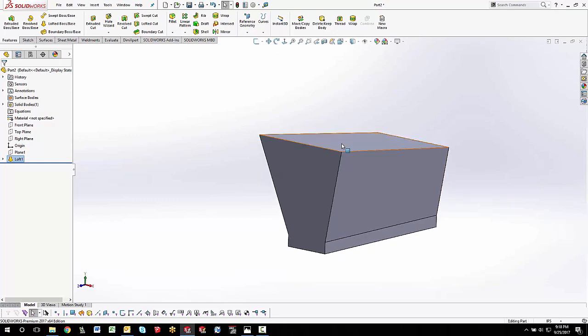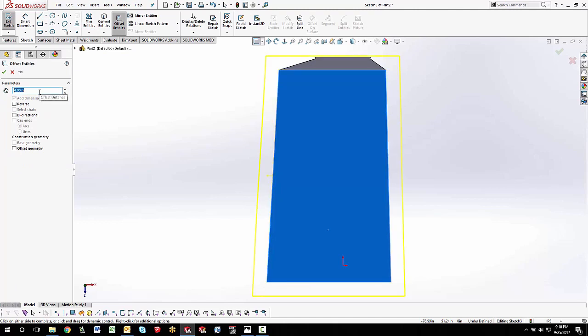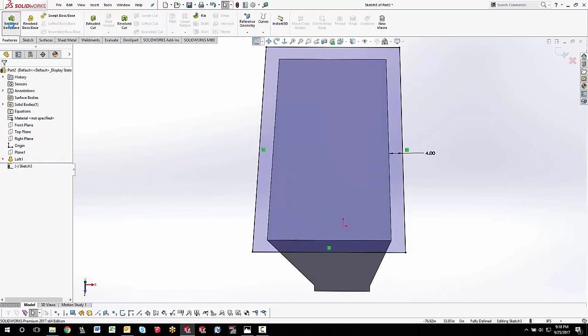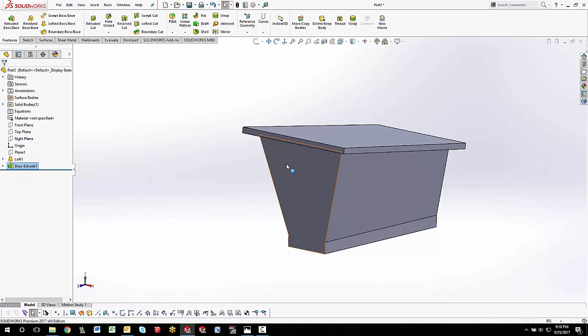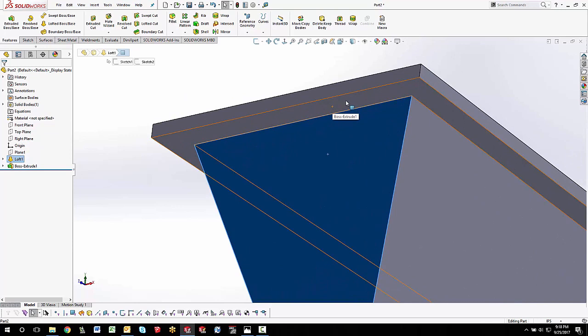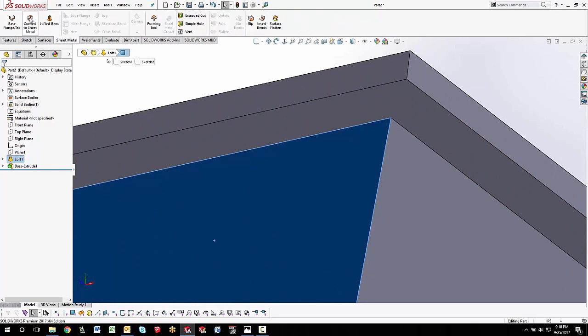What I'm going to do is sketch on this face, do a new sketch, and offset — the flanges are four inches to the outside. That creates the offset. Then I'll extrude this up — it doesn't really matter how far, let's go two inches — because what I'm really looking for is the faces of the part: coming from this face and also going to the face on the other side. Now the problem is I need to split this up. On the sheet metal toolbar there's a 'Convert to Sheet Metal' command to go from a solid to a sheet metal part, but I need to split the geometry up a bit more first.